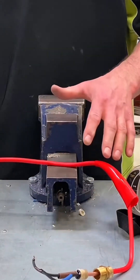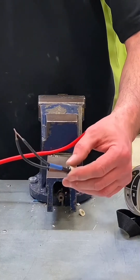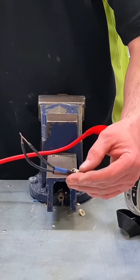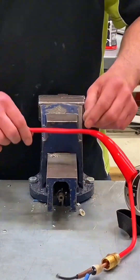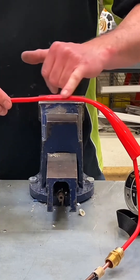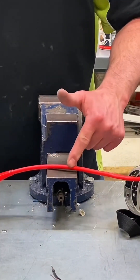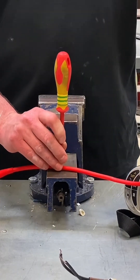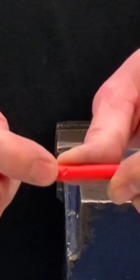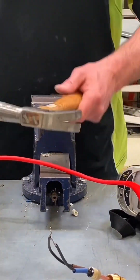So not only is the cable fire-resistive, we know the ends aren't. These tend to be attached to plastic emergency light fittings, plastic-backed bells for alarm systems, and break glasses. So we know the cable itself is fire-resistive and the actual pots that we put on aren't. But we also now know it's a highly robust cable if you hit it with a blunt object. Let's hit it with a non-blunt object in a different area — if I hit it with a screwdriver and a hammer, you can see straight away it goes through. So with sharp objects it won't be as strong mechanically, but certainly you can give it a good whack with a blunt object.